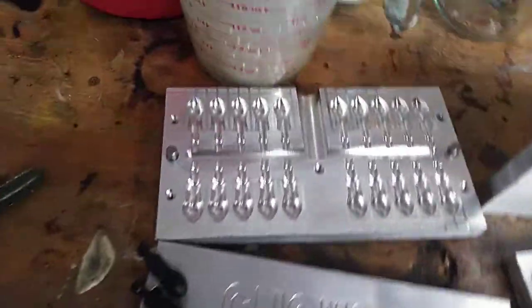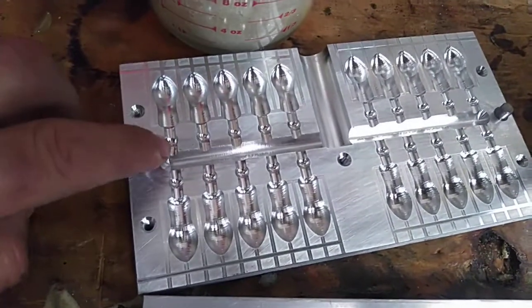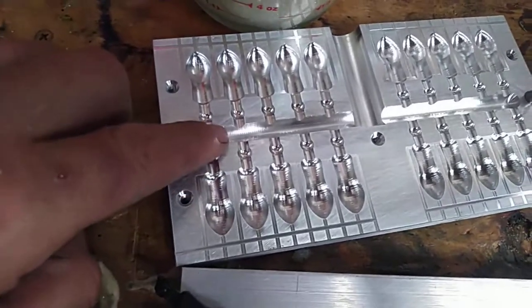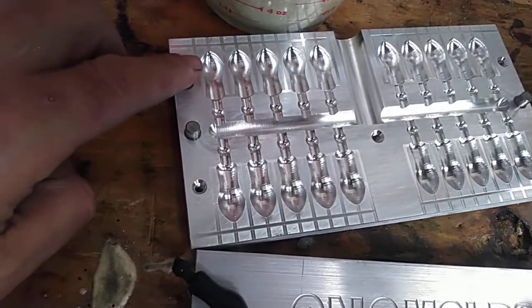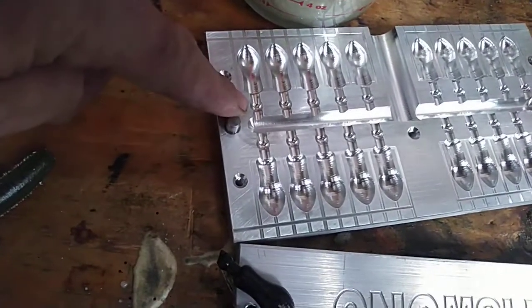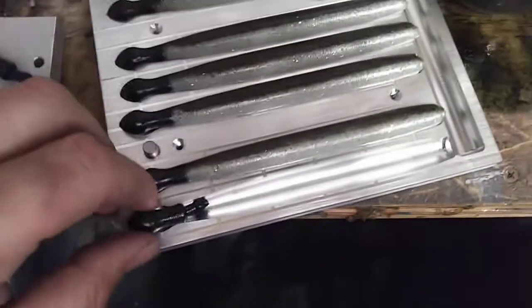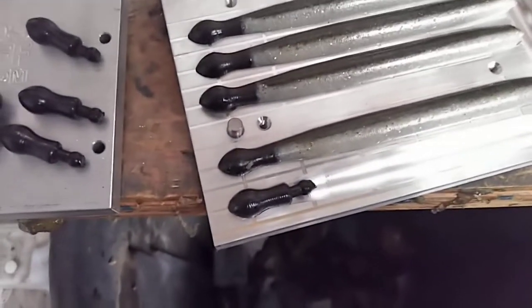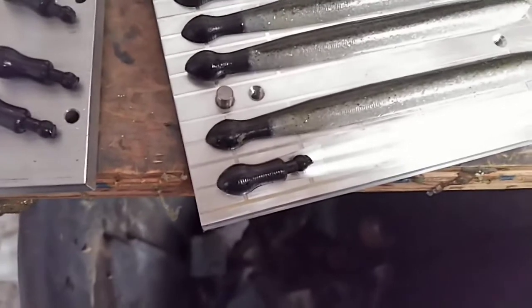And here's the tails and the tail mold. If you're familiar with some of my comments about mold making, you'll know that I like to keep the gates very short — that way there's not a lot of aluminum between the runner and the cavity to suck the heat out of the plastic and freeze the gate off. This is a relatively small amount of plastic, and I had a reason for wanting to keep the runner long on this. I wanted it long so there was room for this little ball in the middle here. When you look at the individual tails, you see I cut it off right behind that ball. So that when you drop them into the mold, the plastic runs around that runner and that ball. It allows it to heat it more because it's got hot plastic all around it. As well as a little bit of a fusion bond, you also get a mechanical bond like the tab on a puzzle piece.